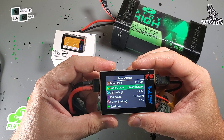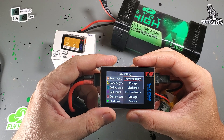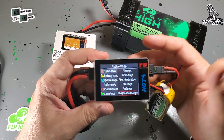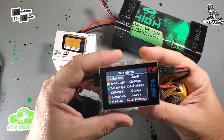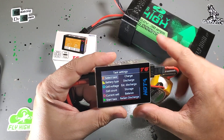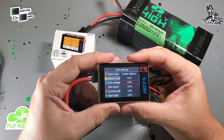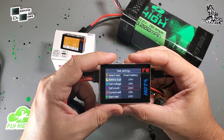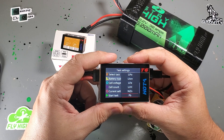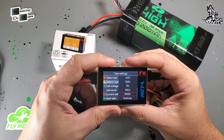This does have a full feature set of different modes. You can use it as a voltage power supply, which is super handy. There's regular charging, discharging, storage, balance, and even a regenerative discharge — where it will take the juice out of a pack and put it into your source battery. That's pretty neat, especially if you've got a big bank. If you're draining your packs and didn't fly, you can put them right back into the bank. For battery types it's got lithium high volt, smart battery, Li-Ion, lithium iron, all the different Li-Ion types, nickel, zinc, lead, NiCAD, NiMH, Eneloop — all sorts of stuff.